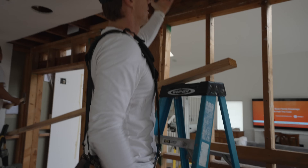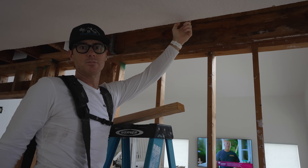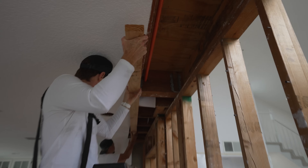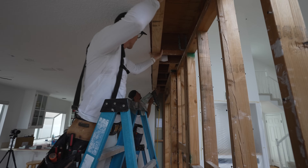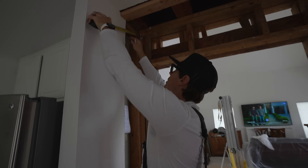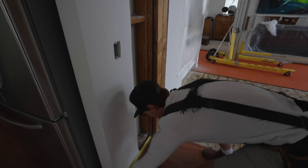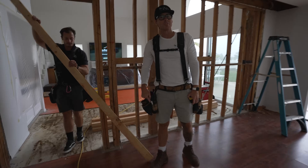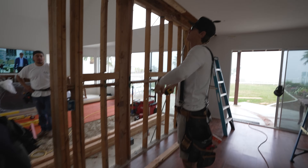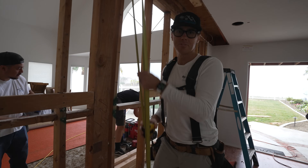We came out from the wall about 16 inches and cut this drywall right halfway on the existing floor joist. Let's go tight against the ground. Just need a couple nails to hold it up in place. Since it's a temporary shoring wall it doesn't have to be in perfect condition. I'm coming off the existing framing and measuring over to this edge — about eleven and three-eighths. I'll follow that line down to the existing sill plate and make a mark. I'll do the same on the other side. That's the reference for putting the sill plate down.